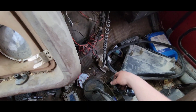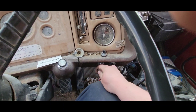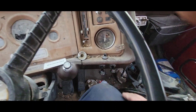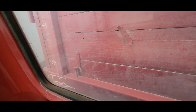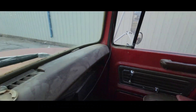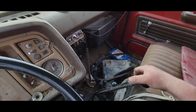Pull this knob, put the clutch in. So with that knob all the way up, idle it up a little bit and pull the knob up — and the bed rack lifts. Push the knob in to lower it. Push the knob back down and the PTO's disengaged.